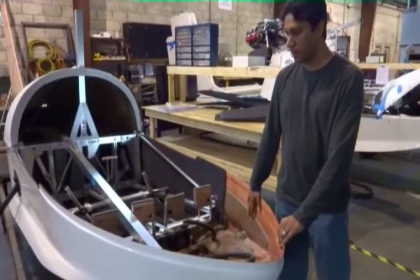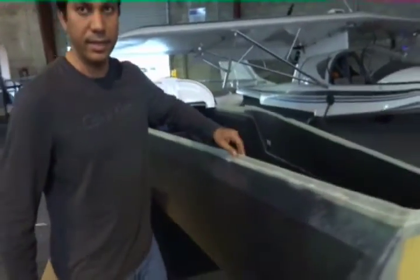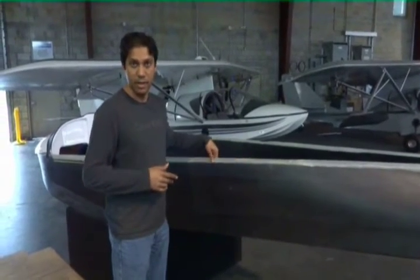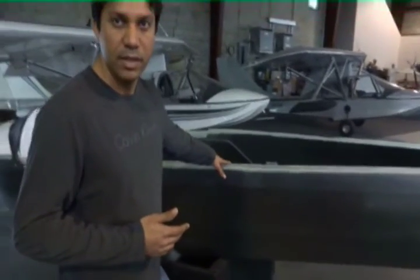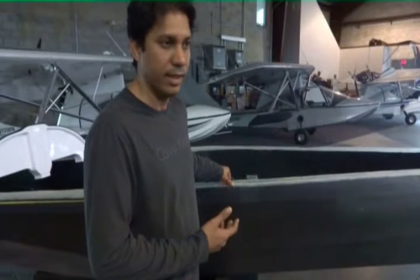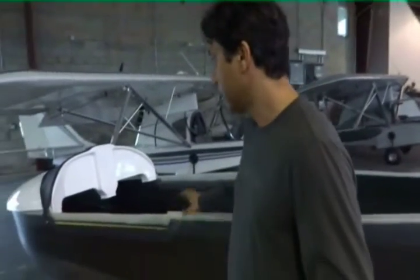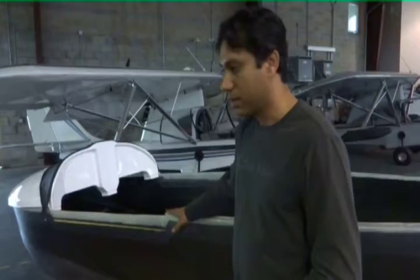What you're seeing here are fiberglass hulls. For the 914 Elite model, we're going to use an infused carbon fiber hull as standard. The difference between the two hulls is about 30 pounds for the same strength. This one is sitting here for first article inspection, which is a type of inspection done to approve the process and ensure hulls are made using the same process going forward. This is the first article inspection hull for the Elite model coming out soon with the 914 engine.